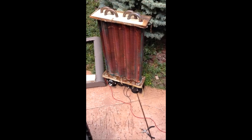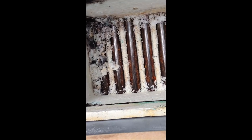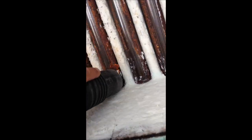Okay, what I did — I took my pressure washer and cleaned up the coil the best I could without doing damage to it, just to remove the green oxidation and discoloration. Next, inside my firebox, as you can see from the leak, it caused some flaking of the insulation material. I'm just going to take my shop vac and clean that up, get it nice and clean, then drop the heat exchanger back in and put it back together.